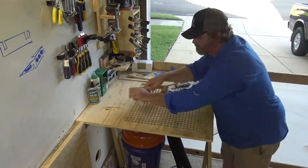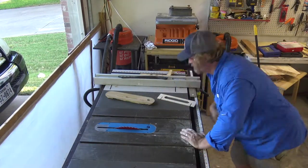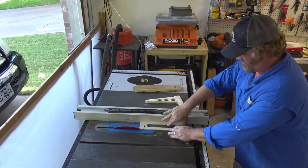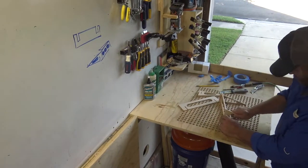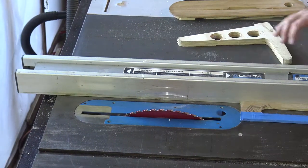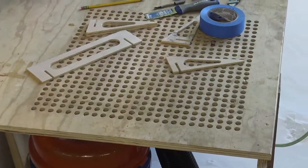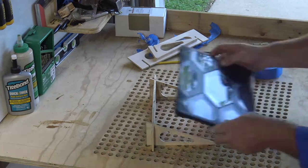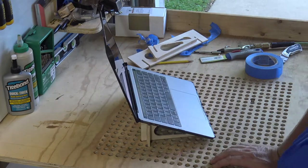I'll give it a test and I need to notch the back at 22.5 degrees so that it lines up with the sides. I should have done this from the start because it's quarter-inch wood which is a little thin, so it did blow out. To relieve that blow-out, I'm going to put a piece of tape on it so when I run it through the second time it doesn't blow out those smaller cuts. This is a wicked fun project — here's a rough look at how it sits on the stand. I think it's going to work really well, it seems really stable.